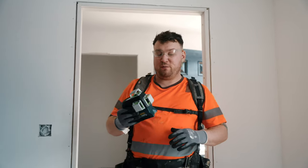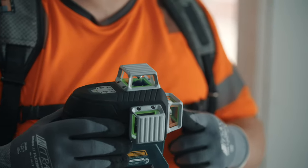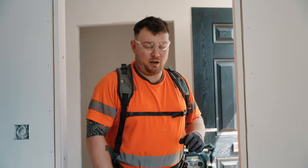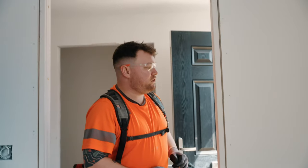To keep things hands free while I'm working on this lining, I'm going to use a laser level. This one has a green laser in it — a lot more visible with the bright light we've got here coming from the front of the house. The lining is in the starting position and I have the green laser level set up on the floor, which has given me a lovely green vertical line to go to down here.